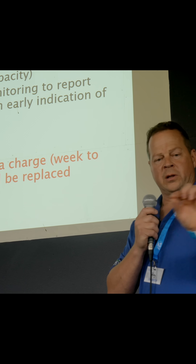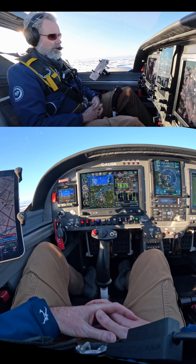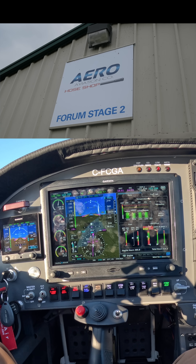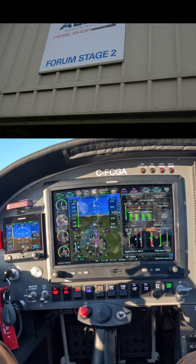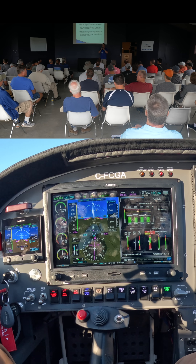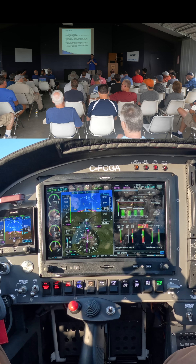These are all the loads I had on, and I made one hour, holding at 12.7 volts for a while now. Amp hours is exactly what it says — amps times hours. So 10 amps for one hour equals 10 amp hours. You just do that every annual, and you have the confidence to know you've got an hour of reserve capacity — and every year, you know you still do.